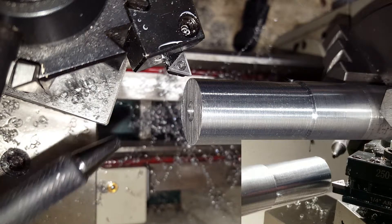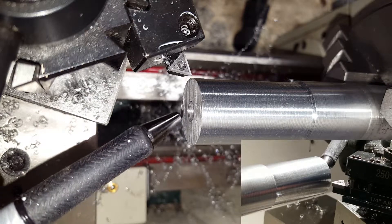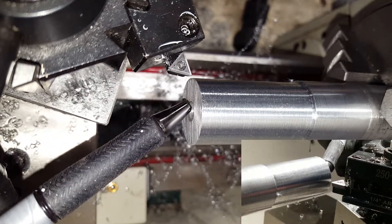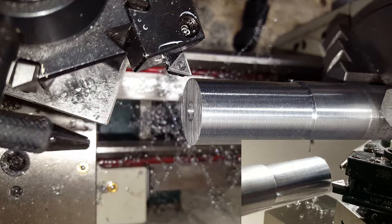This isn't perpendicular since this is my first cut, so I'm going to do a quick cut. I'm going to turn the lathe on and move the cross slide in all the way to the center. Then I am going to turn the lathe off and back the cross slide back.